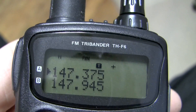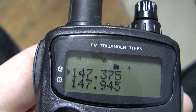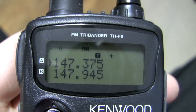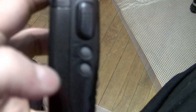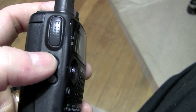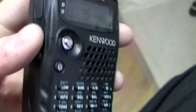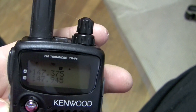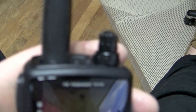Let's see if it will focus. I'm in narrowband FM — that's the FMN. I've got it set at the high power setting; that's why there's a little H in the corner. That T is for tone. This is set for repeater at the moment. It's a small compact unit — the battery is the heaviest part, it weighs barely anything at all. There's your push-to-talk button, transmit, and backlight — which is definitely a nice feature. This is monitor. There's nobody currently using the repeater, which is over on top of URMC, University Rochester Medical Center.